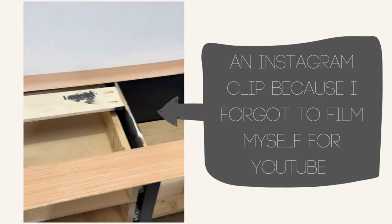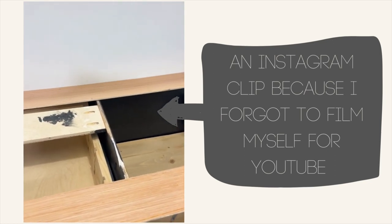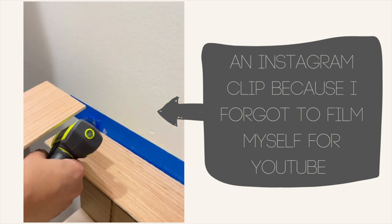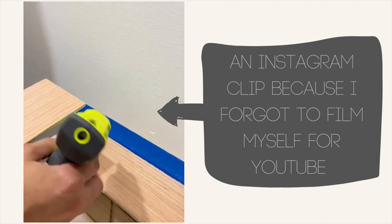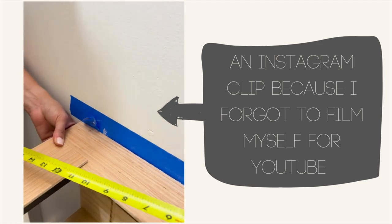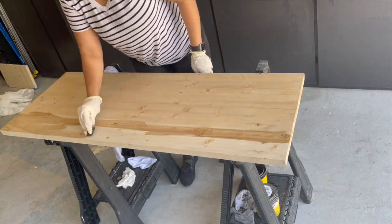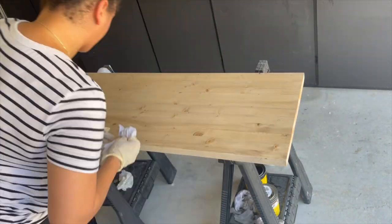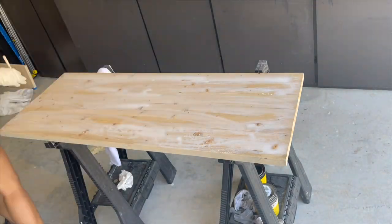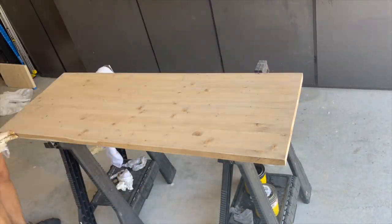Today I'm finally going to cut out the top for the cabinet. I had originally cut a top that was about one inch thick, but I found a piece that's closer to one and a half to two inches thick for the countertop — I thought it would look nicer. Because the walls are not 100% straight, I made a template for the countertop using five millimeter plywood and my glue gun. I wanted my countertop to look like oak without the price of oak, so after lots of trial and error I found the perfect stain combo to use on pine.